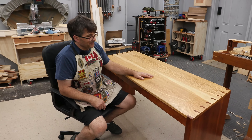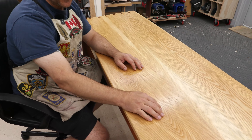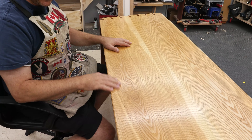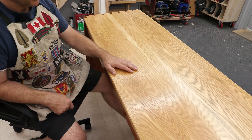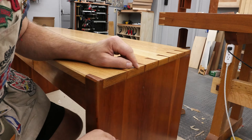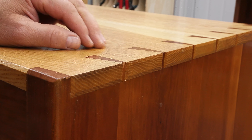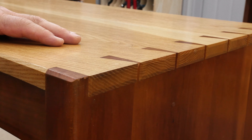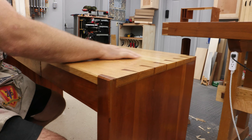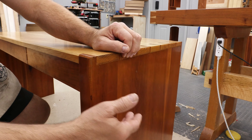This has a nitrocellulose lacquer finish, and after 30 years it had held up quite well. The only problem is that when you're dealing with open porous wood like oak or ash, unless you use a wood filler prior to applying the finish — I don't like the look of that — you're susceptible to having these little pores fill up with dirt and grime. Over the years that was the result, so I had to resurface the top before reapplying the finish. I had designed it with pins and tails left proud and chamfered for a nice three-dimensional look, but trying to work around all those pins sticking up was more than I wanted to deal with, so I flushed them all off.